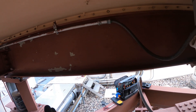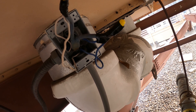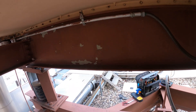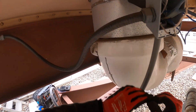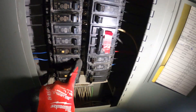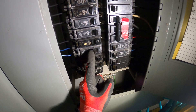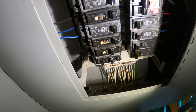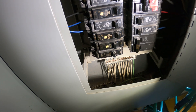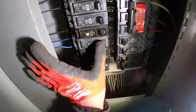I'm just going to leave things the way they are and confirm what they're saying is actually true. So I'm going to connect on the other side and see if it pops the breaker. Then it's going to be a process of elimination where I isolate this heater and that heater. Let's hit the breaker. There you go — you just saw it. Breaker tripped.